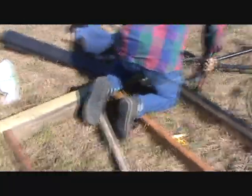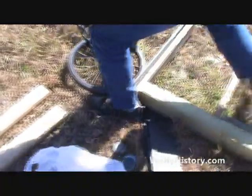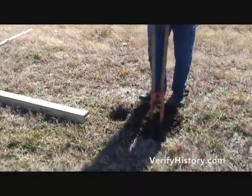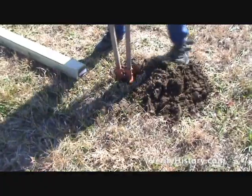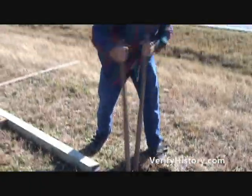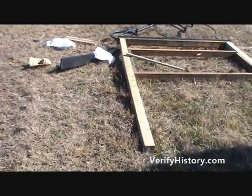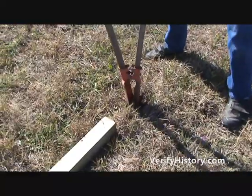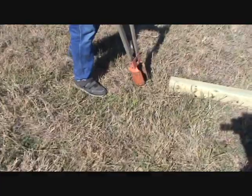Here's our 2x4 frame. We have a 1x4 trim on the outside and you can see that's painted black right there. We're going to find a good location near the highway where it's clearly visible and dig our first hole with post hole diggers. Once we get one hole in, we're going to line it up and that way we'll know where to put the second hole because it's lined up with the second 4x4. We don't have to do much measuring this way.